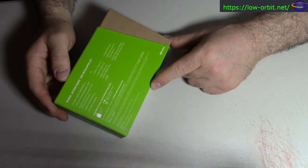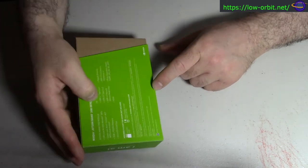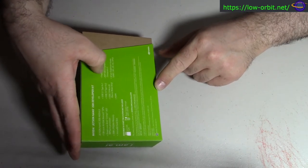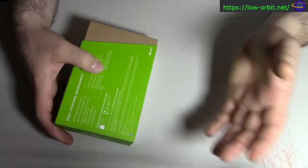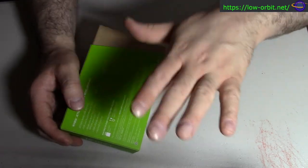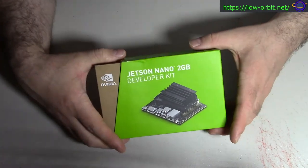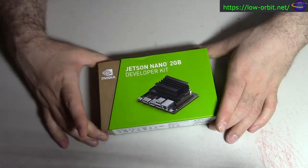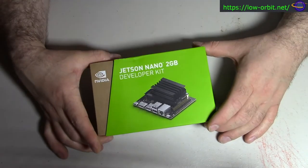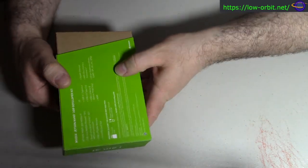It takes an SD card to boot. For I/O it has USB 3.1, USB 2.0, and USB 2.0 micro device mode only. You've got HDMI output, gigabit ethernet, and a MIPI CSI-2 camera connector. That's great if you want to do computer vision — like using TensorFlow to detect objects. That's definitely something we're going to get into. I've been planning to do that with my Raspberry Pis and ODROIDs, but I'm definitely going to test this out for TensorFlow and object detection.